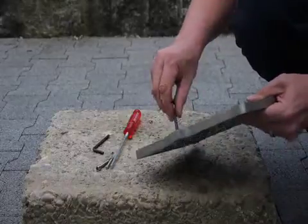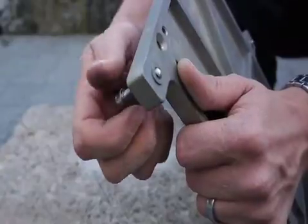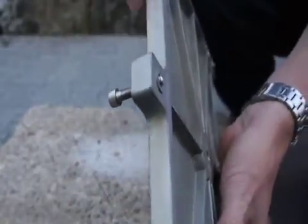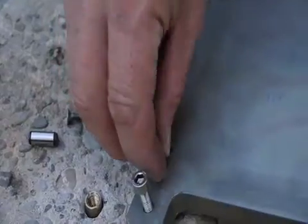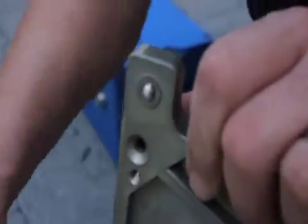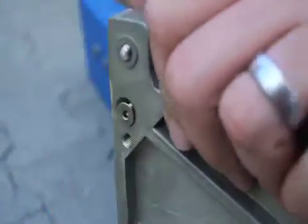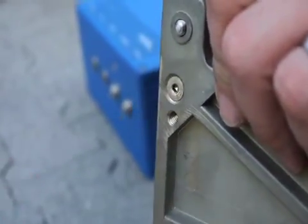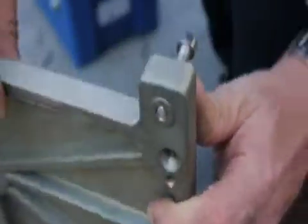Prepare the base plate. There are three ball mounting screws — make sure the mounting screws come out on the other side two to four millimeters. Next are the plugs. You'll require an allen key and securely fasten them with the provided nut on the other side. There should be two of them on both the left and right side in the front of the base plate.